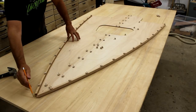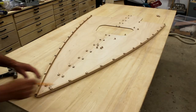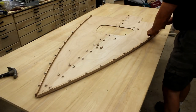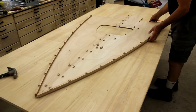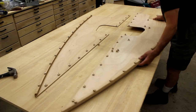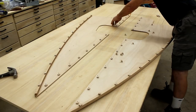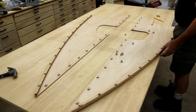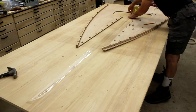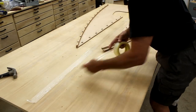Now this is all tacked down. I'm going to draw on the table exactly where it's sitting so we can put it back in the same position. We're going to remove one half from the table and draw down the center line where the tape will need to go. We're going to butt joint and glue these two pieces together and glue down the cleat at the same time. A couple of simple layers of clear packing tape prevents any squeeze-out from adhering the panel to the table.